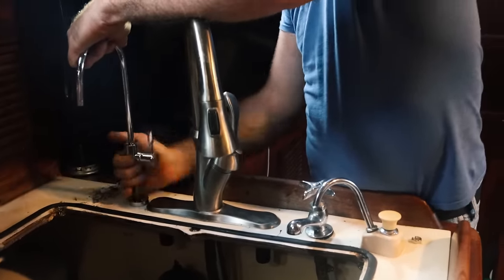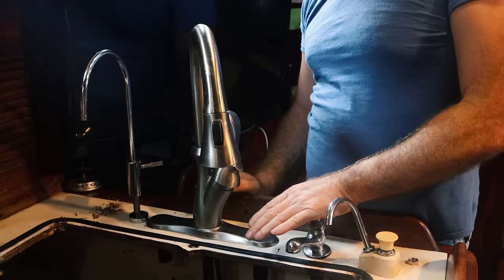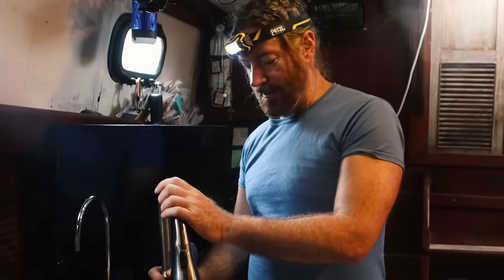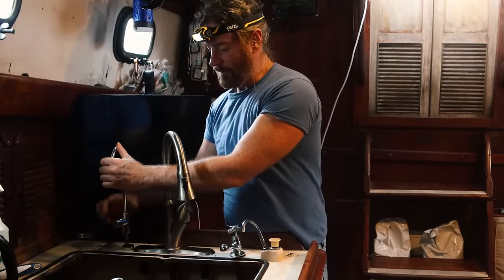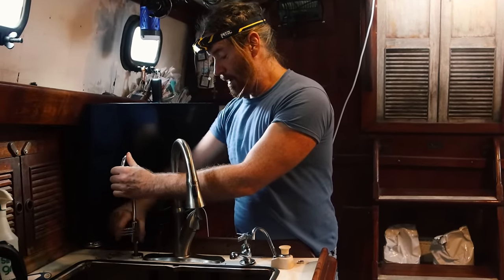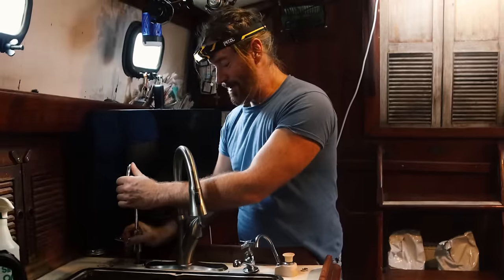What you see, my friends, are all the faucets, all different kinds of design. Manual system, it's got its own tubing. Seawater system, it's got its own pressure vessel and pump. Main house system, obviously vessel and pump. This is the point of use RO system. It has an auxiliary pump and its own filtration system. So it's like some weird exhibition of all the different faucets there. Yeah, it's like a technology through the ages.